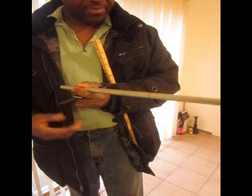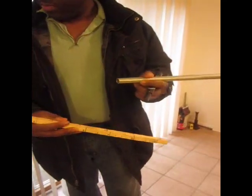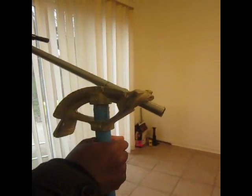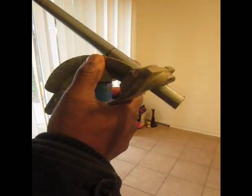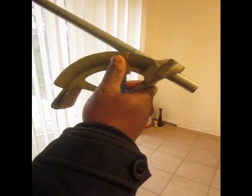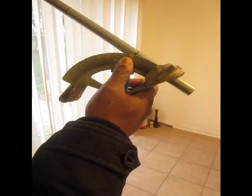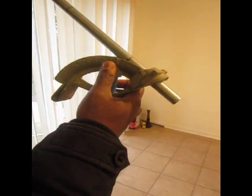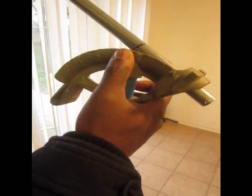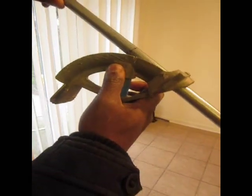Here are my 2 marks. Now I'm going to take my bender and line up my first mark — I'm going to put it right where the notch is in the bender. That's what I'm choosing to do. Whatever mark you use when you're making an offset, that same mark has got to be used for the second bend. So if I was using the arrow, my second bend would have to be on the arrow. If I was using the star, my second bend would have to be at the star as well.